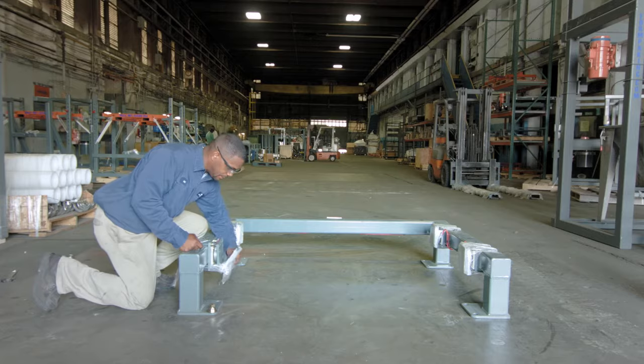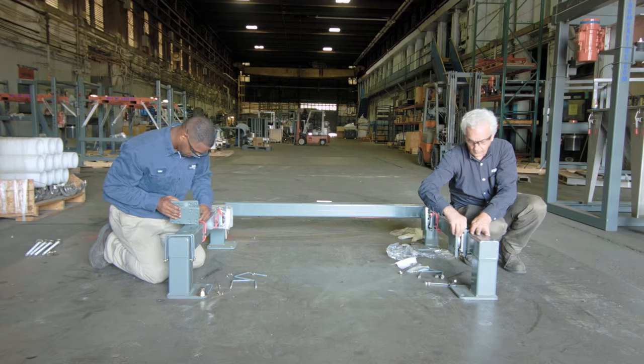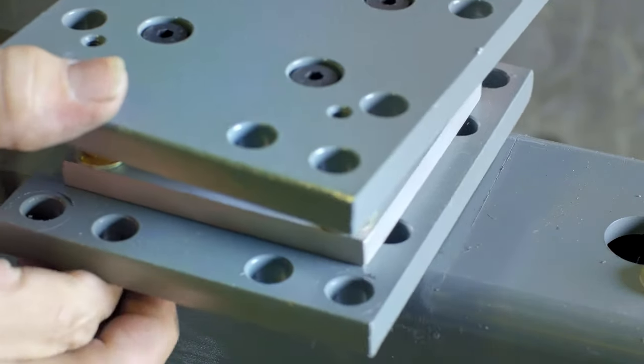Returning to the base, the load cells must be rotated to the top of this frame section. Remove U-bolts and note the lines in the paint for proper alignment of the load cells.